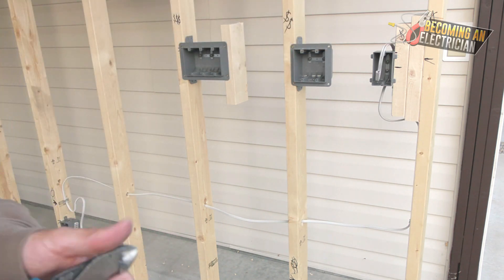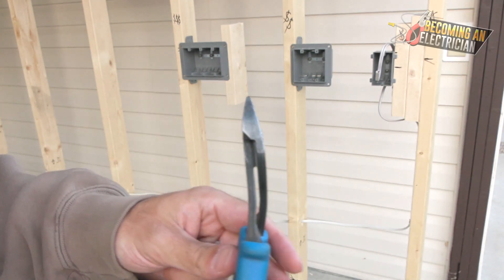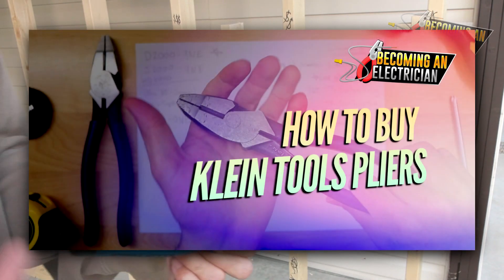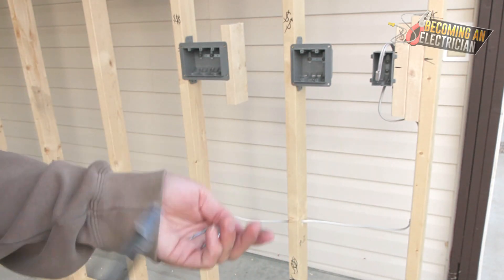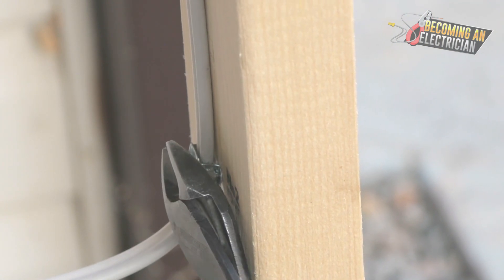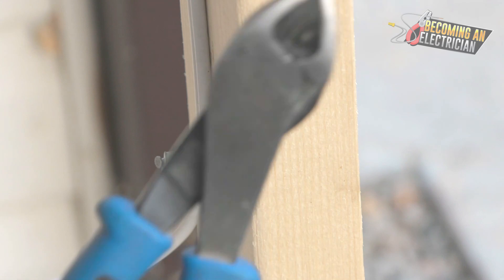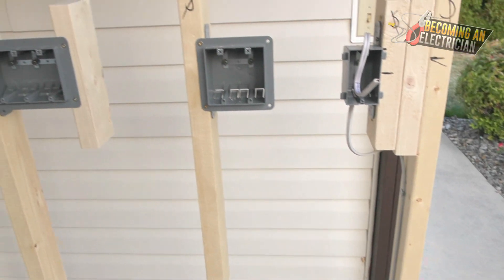My personal tool choices for pulling wire: make sure you get angled side cutters — the Journeyman series with the nicer grips. Check out my video on how to buy Klein Tools pliers to learn about different grips and metal types. You also want a hammer and your staples. The angled side cutters let you pop staples right out with easy leverage, and in tight areas you can even use them to tap a staple back in.